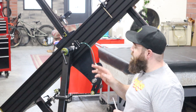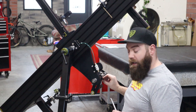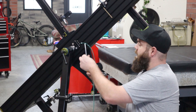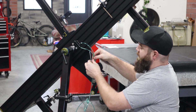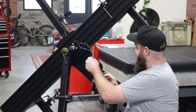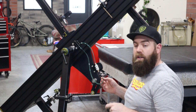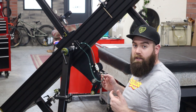The next line is going to lead from the bottom side of our manifold down to our port on our bottom bracket post. Very similar process — I'm going to find the end of my tubing and plug it into the bottom side of the manifold. I like to run it along the line of the tubing going from the switch to the manifold just to keep things neater, then bring it around to the bottom bracket and cut it there as well. This is another portion where it is not going to change in length, so you can keep these pretty short and tight.